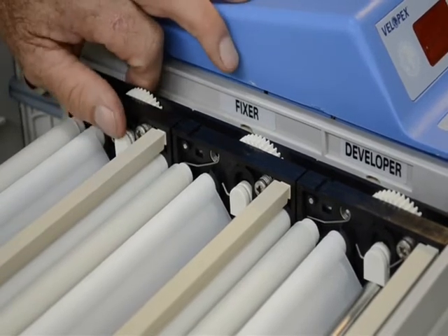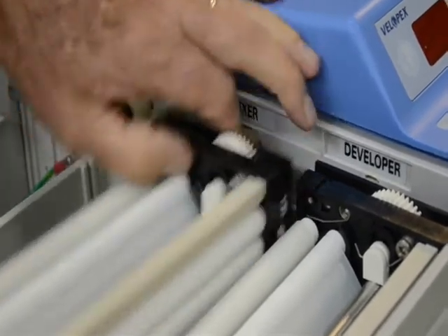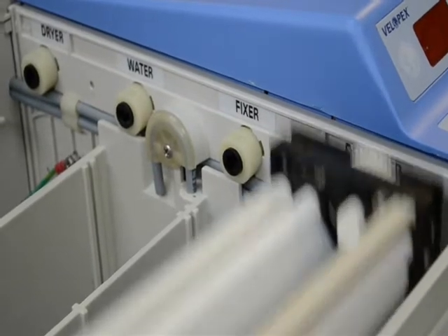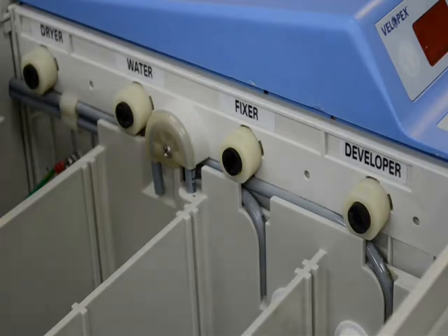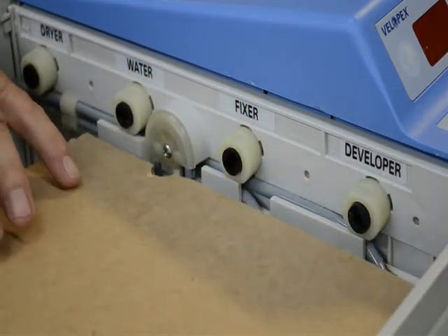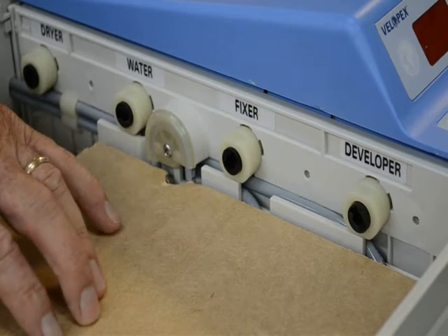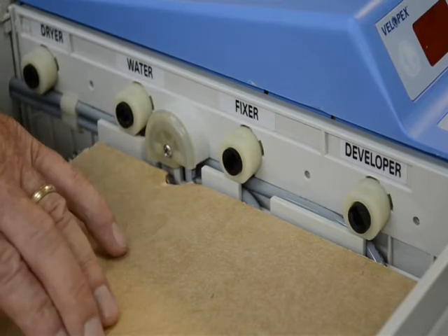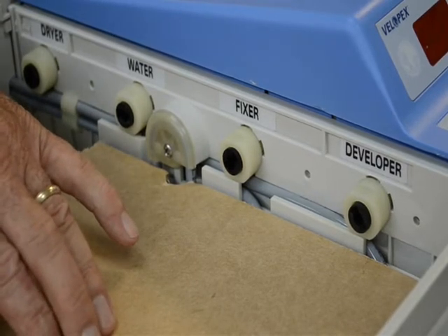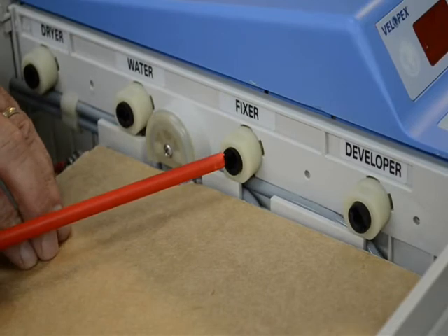To give us working room in our extender, we're going to remove all the modules. We have a lot of small pieces involved in the drive dog, so to keep from losing small pieces in our chemical tank, we've pre-cut a little piece of cardboard and going to lay it right across our tank — it covers the developer, fixer, and water. On an intra, you'll be removing all three tanks and modules, and you won't have to deal with the cardboard because if you drop anything it won't be into chemistry.